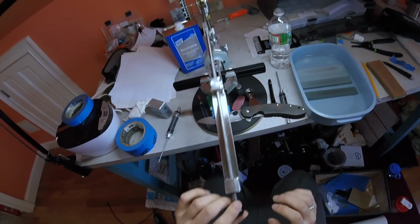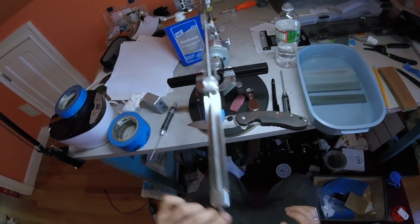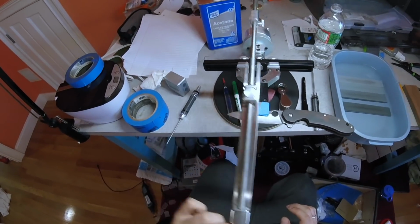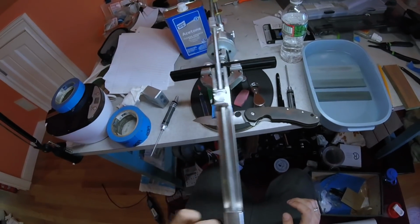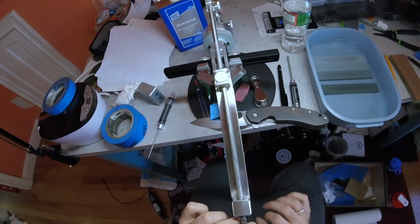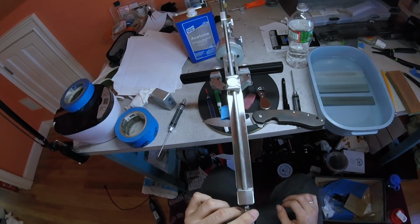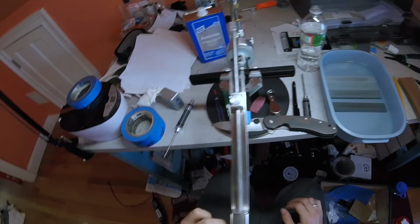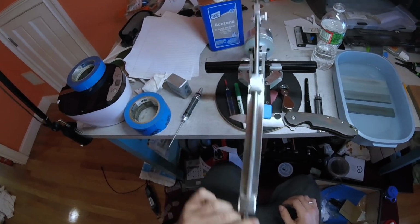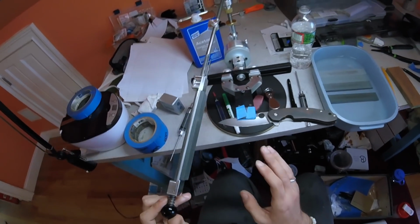What you can also do is this circular stroke. I would only do this in the profiling stage. If you do this, your scratches are always going to be lapping over each other and taking off the most amount of metal possible. This is true with every stone, but it is especially true with diamonds. With diamonds, doing this, you're going to remove a ton of metal very quickly. So go to the most coarse stone for the job that you need.